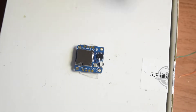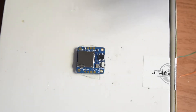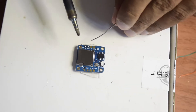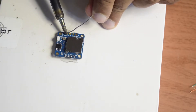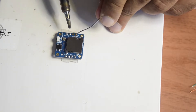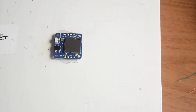As always, before we start soldering let's do the tinning on the pads of this DVR. Here is my HL pin, which I will connect for auto control of the DVR to start and stop recording. This is my video-out pin going to the VTX transmitter. Here is ground and power supply — this is 5-volt in. Let's do the same on the other side — here is 5-volt out and ground out. Be very careful while soldering so that you do not short these pads or overheat them, as that will damage your chip.